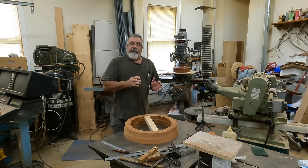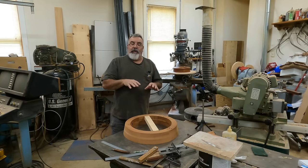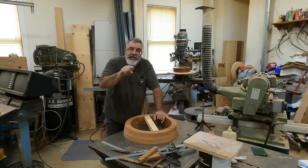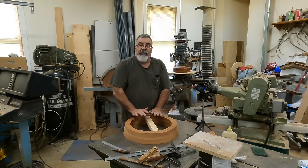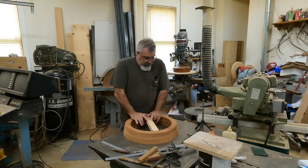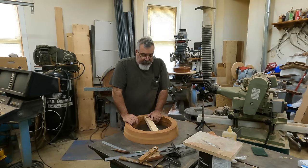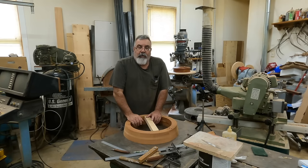I'm going to have that mounted on there, then shove this quarter piece in there, pour plastic, and get that inside shape on there — that's going to be the core stick. Then this all has to go back together after we're done making a core box out of that one quarter core piece. Next thing I'm going to do is get the inside of this thing done, sand the inside out, then start cutting this apart and getting it ready to pour plastic.